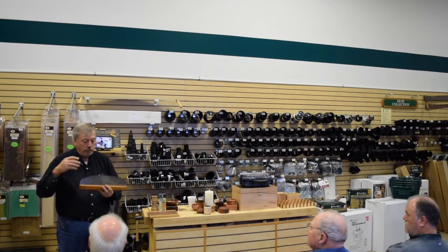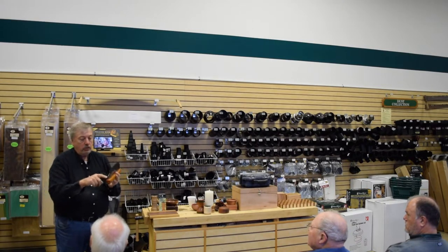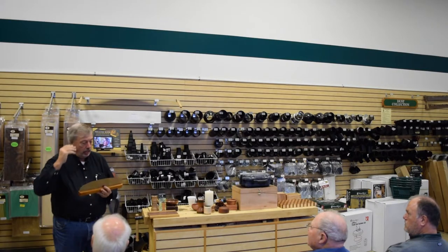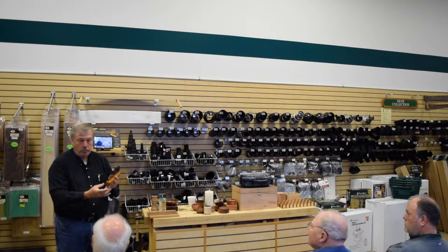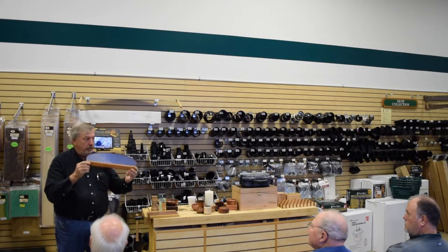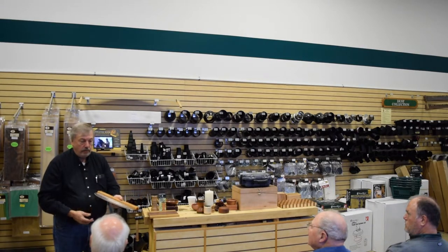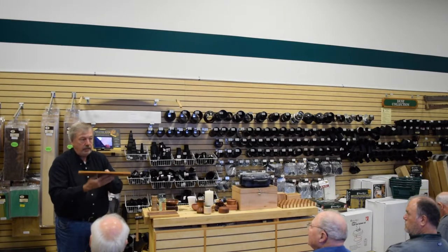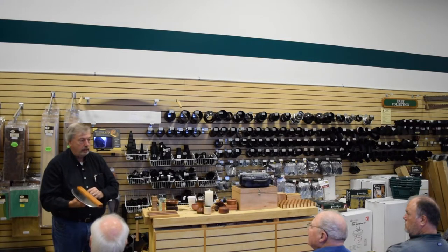Before you put this on, you're going to do all your sanding and finishing. Now, there's two little holes over here and two little holes over here. If the mood should strike you and you want to drill holes in this to put pins or screws in those little holes on each side, good luck to you, because these are buried. If you were to lay this on top and do everything we're doing, this is very hard to do. What you'd have to do basically is make a sled that will support everything. And then while this is on the top held in place with double-sided tape, you drill your holes through here and go all the way through. And then if you did everything right, they'll line up.